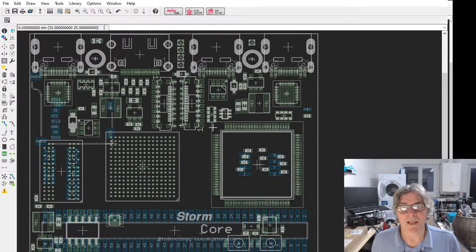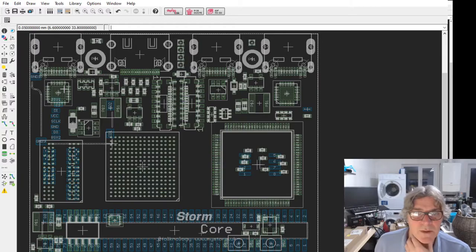So it's a nice simple layout. I'm still optimizing it slightly, still working on the routing, and we'll do some work on that schematic today. I've also found some issues with the library parts, particularly the USB one, which someone's clearly done a copy and paste on and gotten wrong. There are lots of different versions of these ULPI chips, and they are subtly different, and somebody seems to have done a copy and paste across a bunch of these on the parts that I've got. So one of the things we need to do, probably today actually, is go in and edit that.